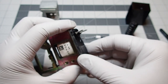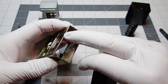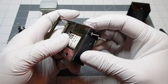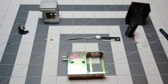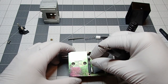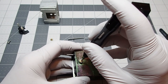So where I ran into some of the initial challenges was this black plastic piece fitting inside this cage. So I did sand down, deburr all of the edges here, make it as smooth as possible. And then once I completed all of the sanding, this is really just a press fit in, just like that. And then you'll see those two holes there. And my screwdriver, let's see here, flathead. And the plastic piece here does not come tapped. It doesn't need to be, just by threading in screws is enough.